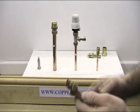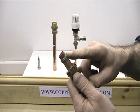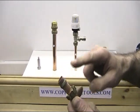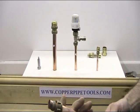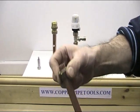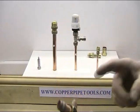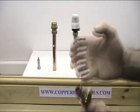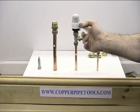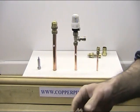What I want to talk about today is this compression fitting ring - also called a compression fitting olive or compression fitting ferrule. Different names for it. This one has been used and you can see it's compressed onto the pipe. The point is that from time to time you need to get this nut and olive off the pipe - maybe to replace your radiator valve, shower unit, or other type of plumbing fittings.